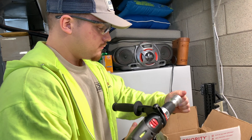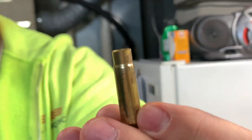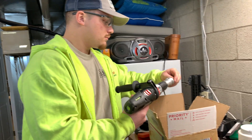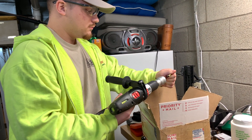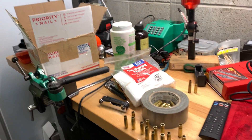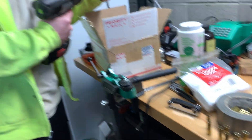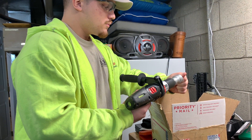Here on the screen is the SEC symbol holding a drill. What's in that drill is the little trimmer — it's called the World's Finest Trimmer. Little cheap tool, but a nice tool. All it does is trim that brass down to the length you want it. We have a set screw in there for the bit inside that cuts it down. It did a good job. We were out of spec a little bit — it wasn't doing what we wanted it to, but we ended up figuring it out. You'll see in the next video what I'm talking about.